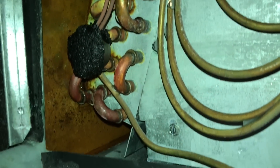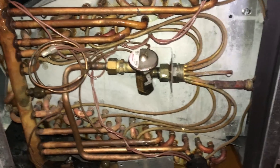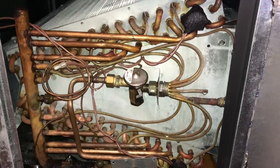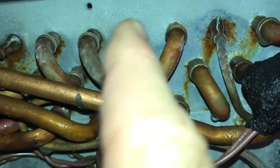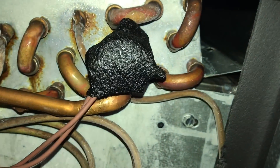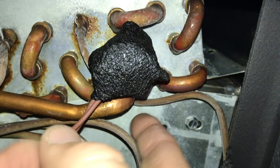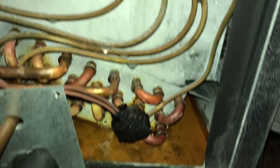Now I have to say, this is a voiceover because this video was sitting on my phone and I was about to delete it. But I figured, why not just put this out there and let people see a refrigeration coil — one that somebody butchered, and two, how I locate that it's a restricted coil by pulling my blower. All of these U-bends here should be frozen — they shouldn't be freezing unevenly. They all should pretty much be freezing evenly.